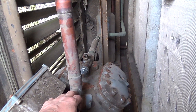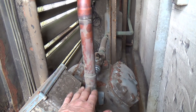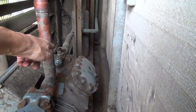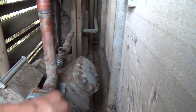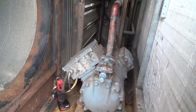It shouldn't leak back for it, should it? I think we'll have to get the bottom out. Shut that valve in, dump it in the high side, then we can valve that off. Plug it out there and suck some oil out. See if we can bring the level back to where it should be.